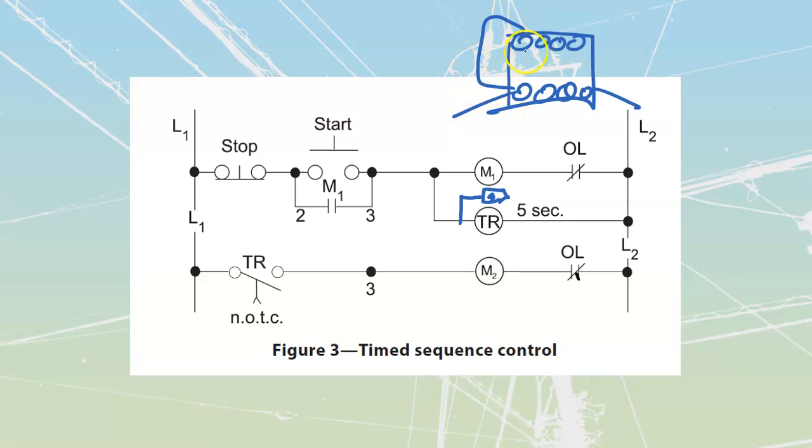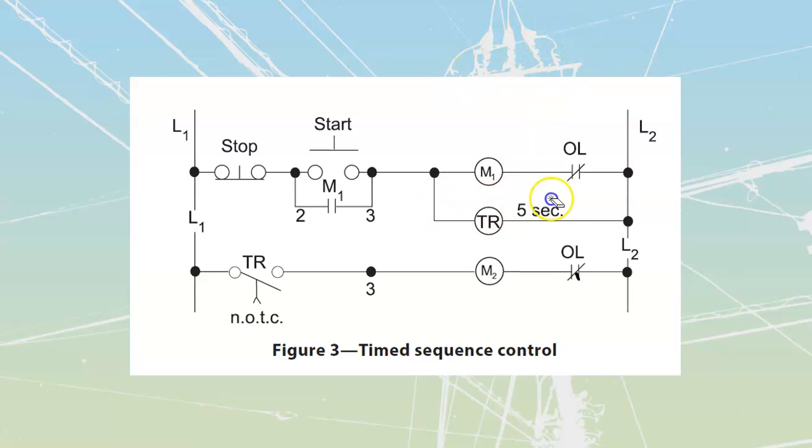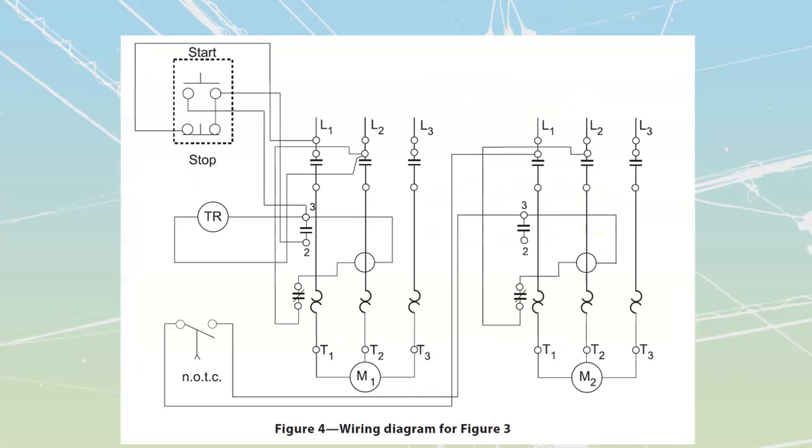Usually we're just going to end up having a short from here to here, going from the positive side of my timing relay. If it is going to be DC bias, I'm going to short those 2 together. Once again, just follow your manufacturer's documentation. But know that if it is going to be a digital timer, you also have to apply power in most cases to the actual signal terminal. Expect to see more digital than pneumatic and hydraulic in your lives.